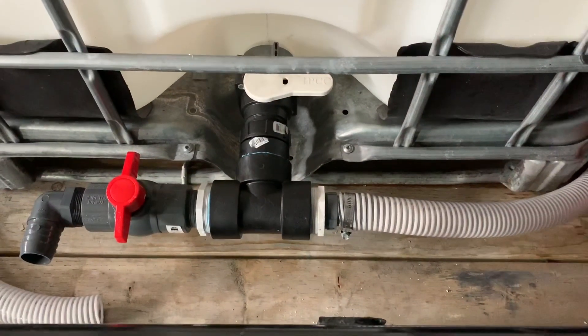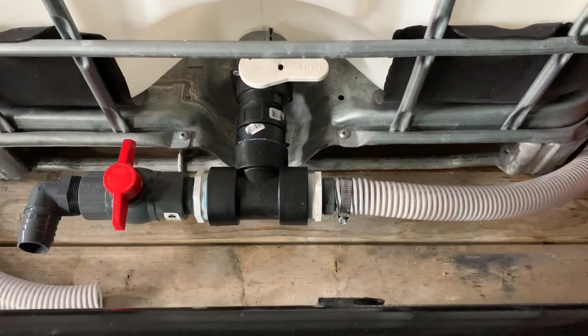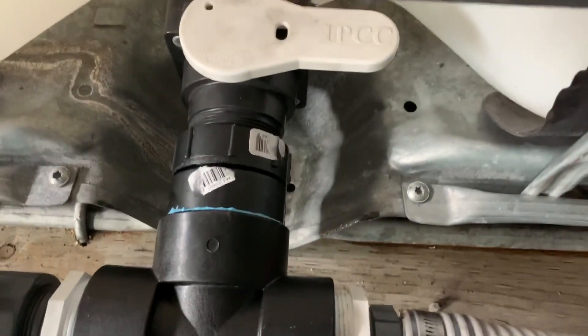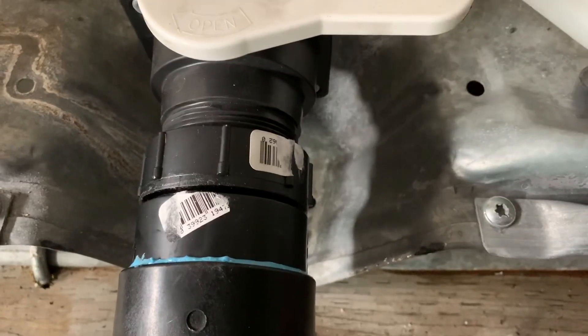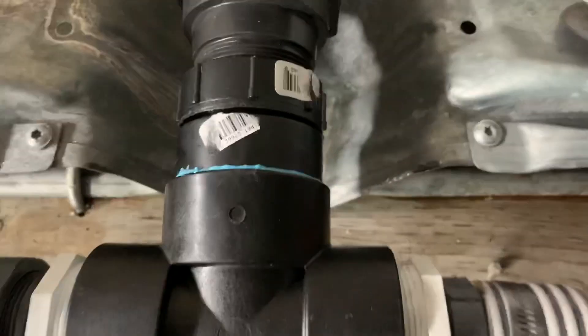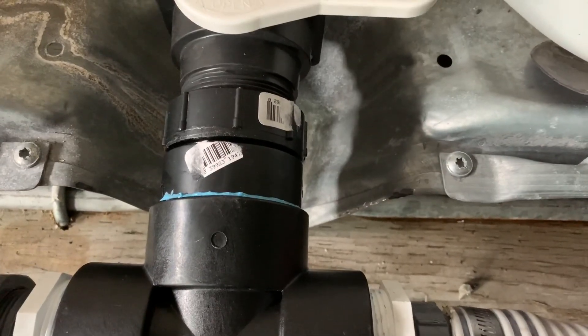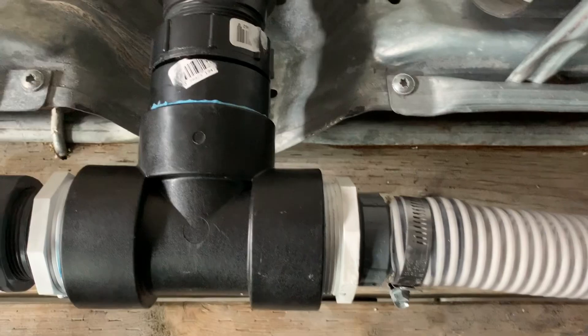This is if you're going to plumb your IBC tote and it's sitting to the side of your trailer instead of facing forward. So it's two inches coming out of the IBC tote, it runs into a little collar there. I used pipe dope on all the connections just to make it tight — it's not as important with the water, but I definitely didn't want to suck up any air into the pressure washer and cavitate the pump.